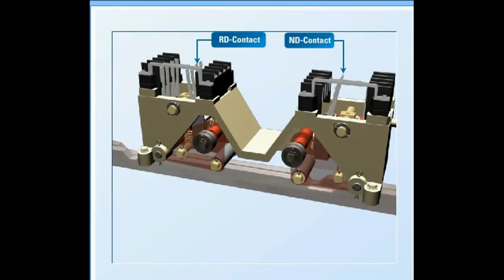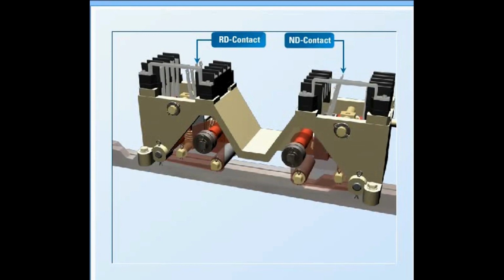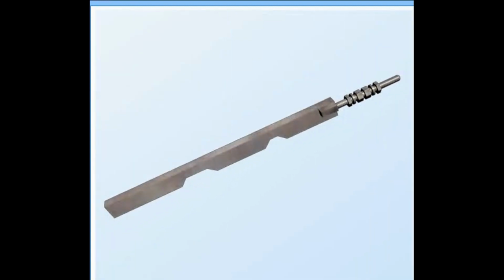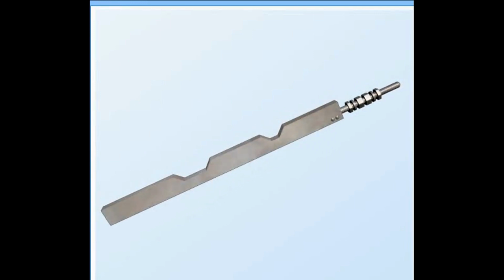At one end of the slide, a threaded rod is riveted and welded, to which the ground connection rod is connected using a lug for easy adjustment of the notches to the requirements. The idle movement of the slide is limited to 3 mm and 53 mm in short and long notch when the roller B inside the detection contact assembly drops in the notches.